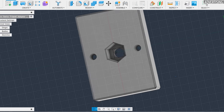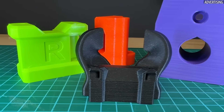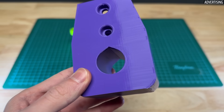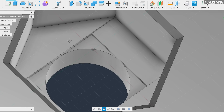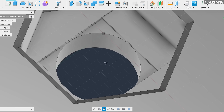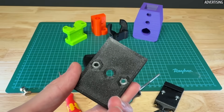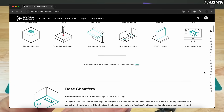We should also briefly discuss the design itself — in many cases the need for support structures can be avoided through clever design. One of my favorites is a trick for unsupported holes: constructing 0.2mm thick bars that support the hole and prevent the printer from printing in mid-air. There are many instructions and tips on how to do this on the internet, such as this guide from Hydra Research, which I've linked in the video description.